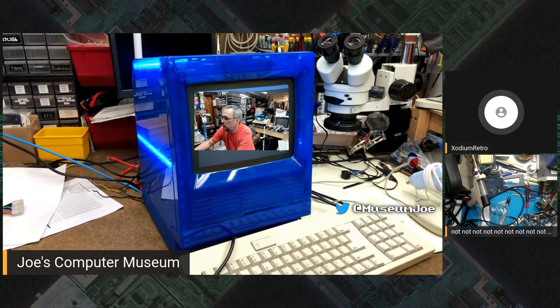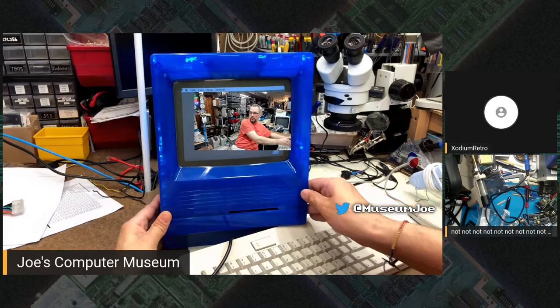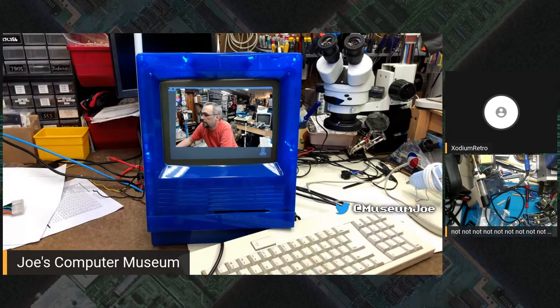The reason I bring up the RP2040 is because I know Justin's been playing around with trying to make a BlueSCSI-based device on another SoC, potentially for performance gains. I'm invested in this because I really want to see the BlueSCSI break the speed barrier a little bit, because as of right now I believe the best you can get is 2 megabytes a second on the F4. And the F1s are capped at like 1.2, if I remember correctly.